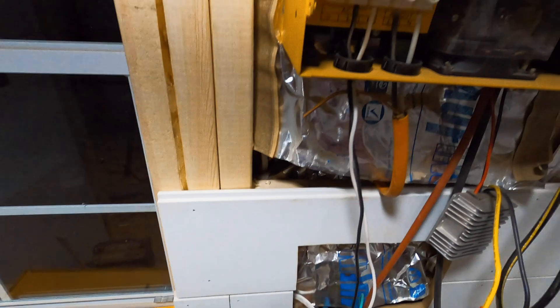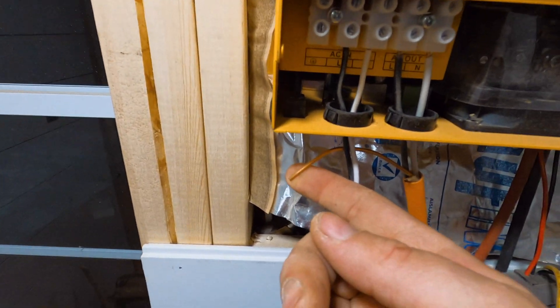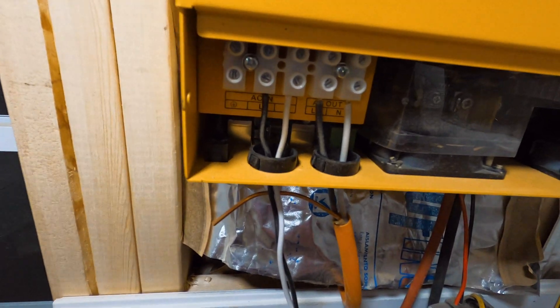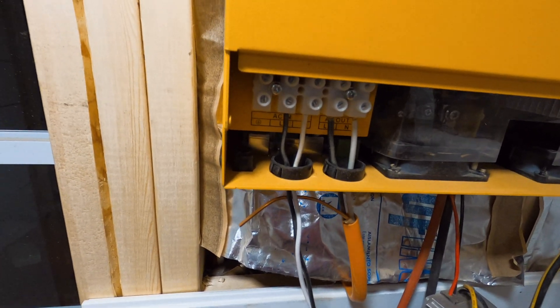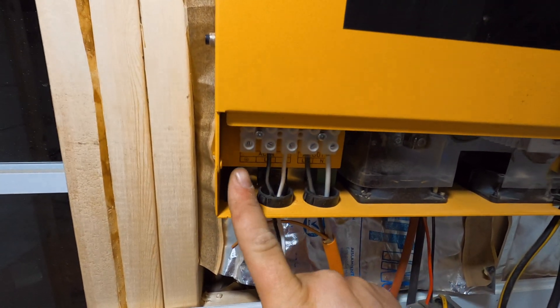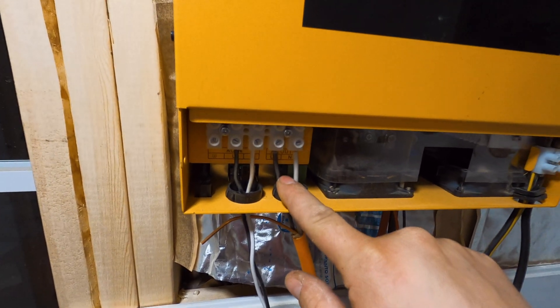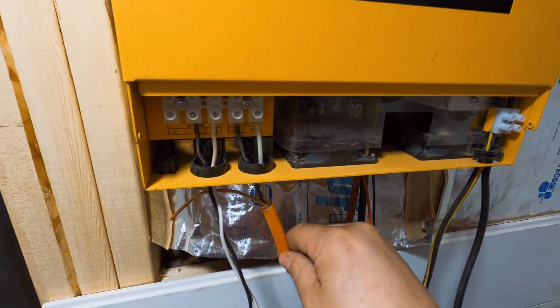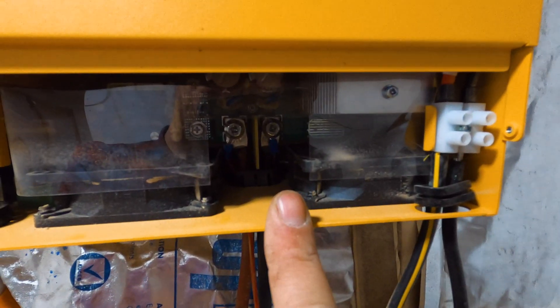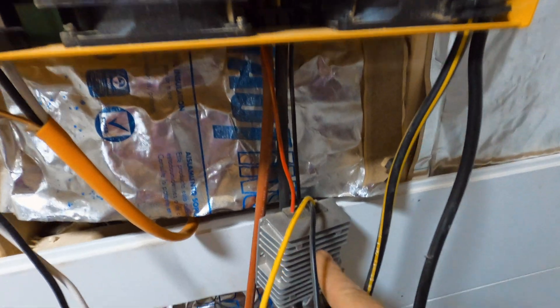Here's the cover — it's just two Phillips screws, one on each side. We have your utility or generator input here. I don't have the ground hooked up because I'm running on a GFI outlet of the generator and my generator is a bonded generator. There are floating ground and bonded generators — this one is bonded, and when I do hook that up it trips the GFI on the generator, so I've just got the two wires hooked up for now. These are the outputs — they go out to my panel. This is what the inverter is actually producing or bypassing, going from these wires to those wires and out to supply my panel. Over here we've got the battery positive and negative input — you can see those wires hanging here, and I also have these attached to supply the converter box.